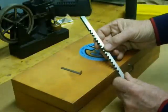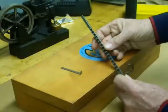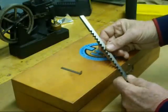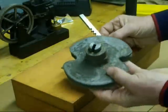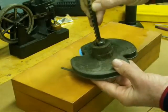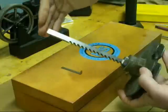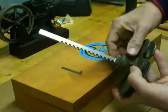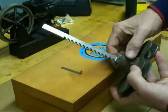There are also square broaches that you can force through a round hole and end up with a square hole, and hexagon, and all different shapes — but we're interested only in the keyway broaches today. What we're going to do is take this pulley, put the broach into the hole, press it through with a little lubricant on the arbor press. We'll do that twice — first without the shim, and second with the shim.